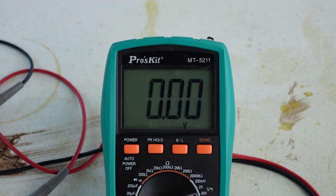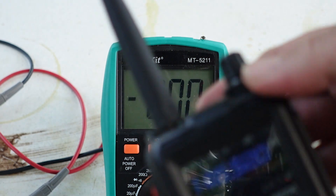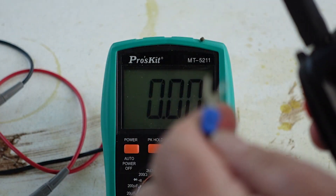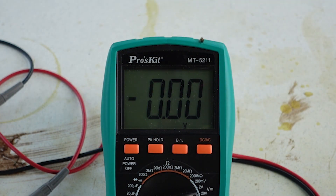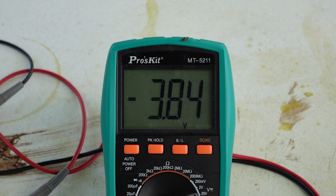So let's grab our tiger tail. I've just got a spade terminal that I'm going to slip in there and screw the antenna down on top of it — it's not as scientific as I'd like, but it's what we got. We're still on national call, and the tiger tail is hanging down — that's a quarter wave on two meters. Let's see what we get. Not much difference. Actually, it's less. KN4YCD test, one two three four. That is not what I'd expected.